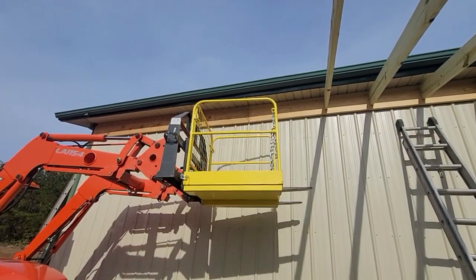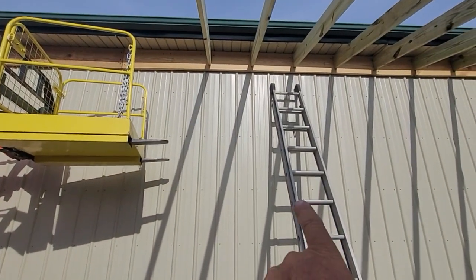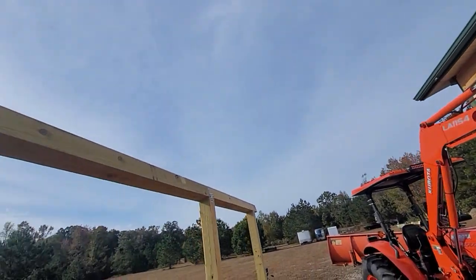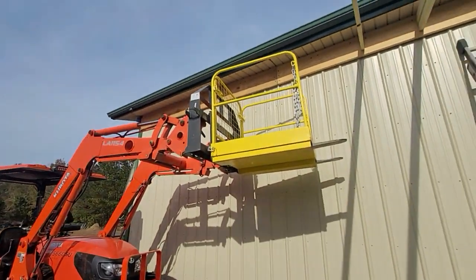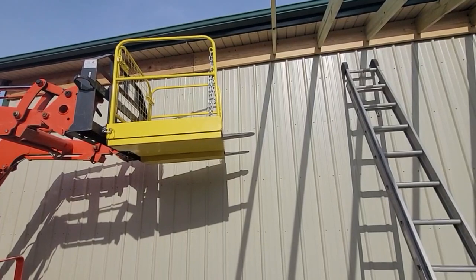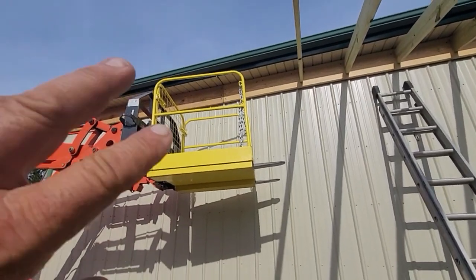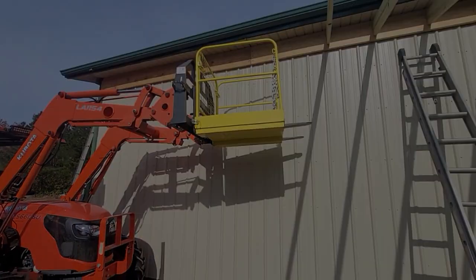I can also do that one without having to move — I can do both of them. This ladder will be moved over here, you'll see. Cut the rafter, bring it in. I put the tail end, stand it up there, then walk this one up, sit it on that fork, go up top — I'll show you what I do up there. Then repeat the process for the second one, and then I have to back up. So let's do it.